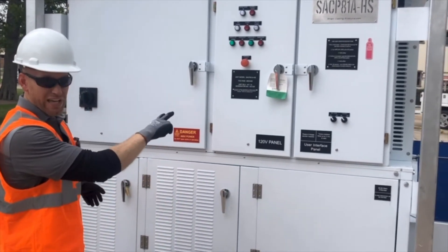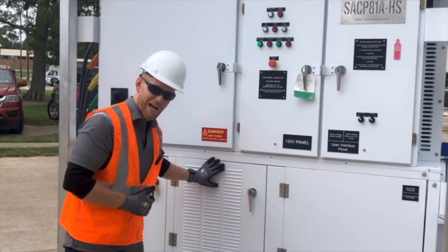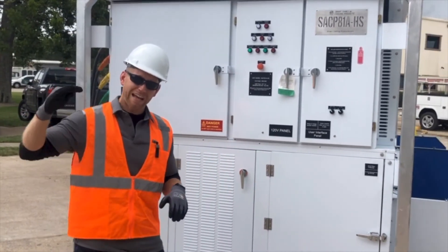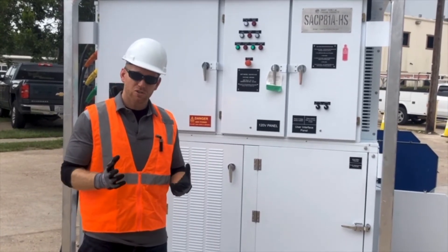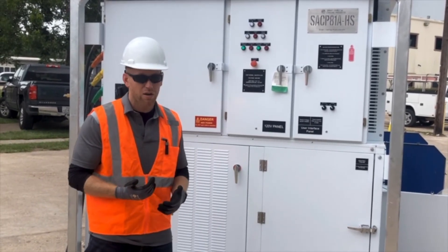After my time delay for compressor two makes, we'll hear compressor two come on, kick in, and start cooling. When the compressors start to come on, we would expect our leaving air temperature to start to drop. It's about 90 degrees here, so I can achieve very easily 55 or even 50 degree air with this machine.